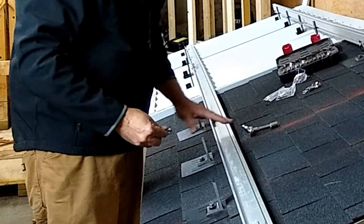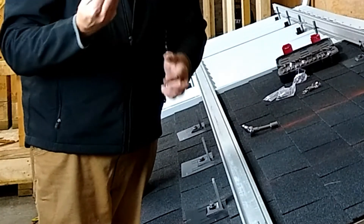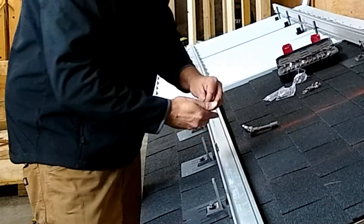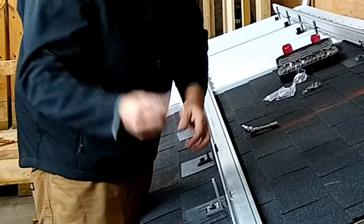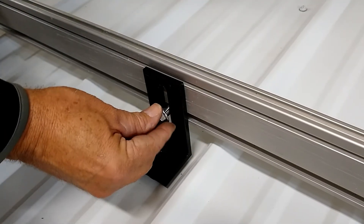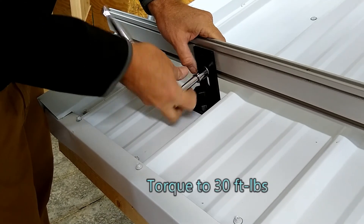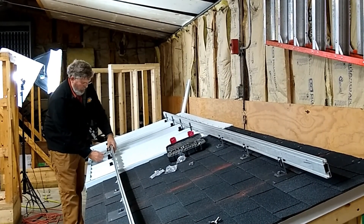Once we go to put the bolts in, we need to attach the footers to the rail. There are typically two different systems. One is a bit of a pain because you have to take the bolts and slide them in from the end — if you forget to do that, you'll have to back up and do it all over again. The other type of bolt you can put in and turn and it will lock in place, so I recommend those. Simply insert the bolt into the footer along that slot, put the nut onto the bolt, ratchet it down, follow the torque specifications given in the instructions, and repeat this for every footer. You're just about done installing your rail system.